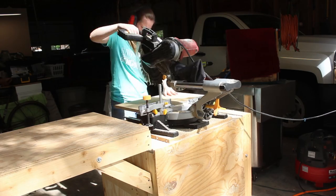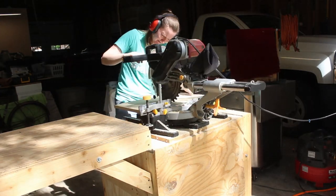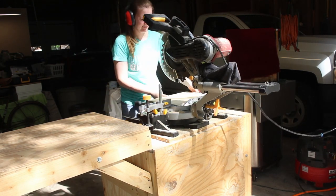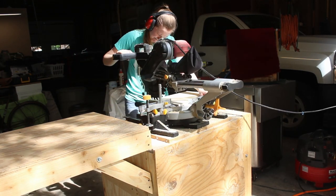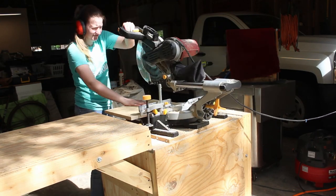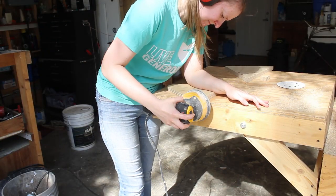Once the ladders were done, I worked on the plywood supports at the top of the triangle. You don't need much plywood here — I just used some scrap I had around. I drew the triangles into the plywood; they're isosceles and therefore easy to draw if you know the base and height, then cut them out with the miter saw. To curve the pointy ends, I cut off the excess plywood, then shaped what was left with my orbital sander.